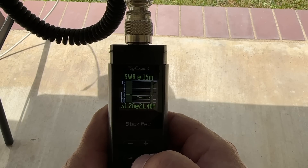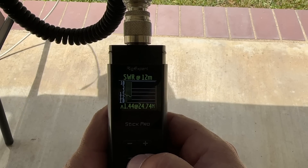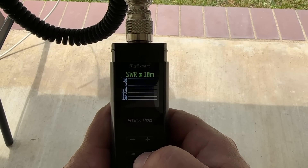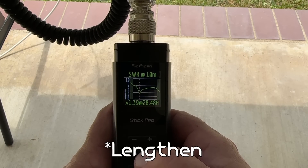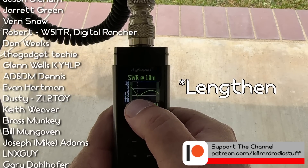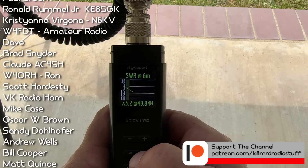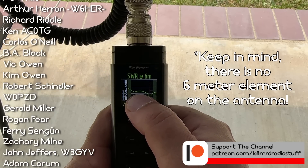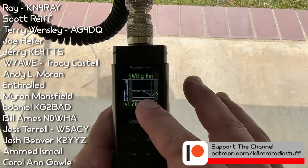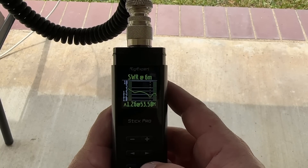15 looks pretty darn good — can't complain with that. I do have a 12-meter element on — 12 meters is pretty good even though the wind is making it wonky. 11 meters, you CB guys, not so much. 10 meters I need to shorten a little bit — I think we lost some bandwidth, and I'm more concerned about the lower portion. I'm going to shorten it to move the dip down so I can get more in the FT8 and phone portions. And 6 meters is actually not bad — we're under 3.1 across the entire band. It's a four-megahertz-wide band, so that's what I expect. My radio will tune it, no problem.